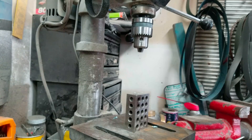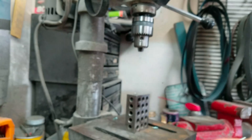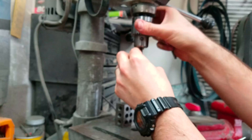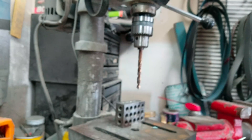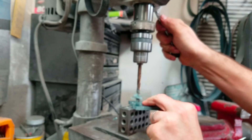I use pilot point bits because it sits inside of that hole and keeps from rattling around too much. That size perfectly fits the 8-32 screws from McMaster-Carr. Drill down in there.